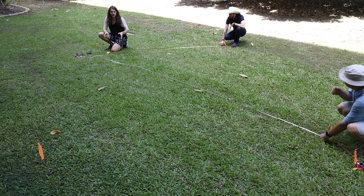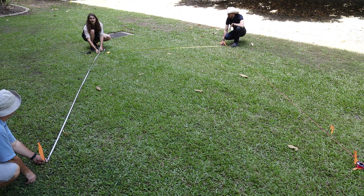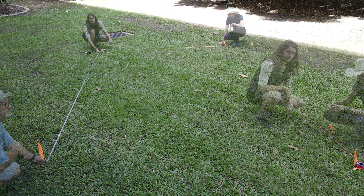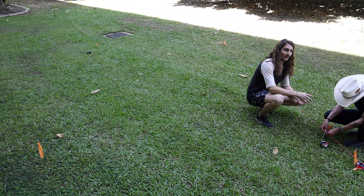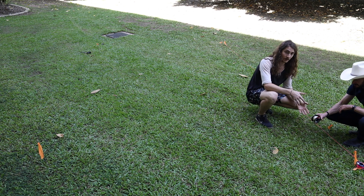Now we check that everything is correct — if done right, it should be four meters from that corner to this corner here. It's important that all strings and tape measures are tight, otherwise measurements will be slightly off. Now we run a string line around the outside so you can see the square, and then we'll show you a further refinement to make it more accurate.